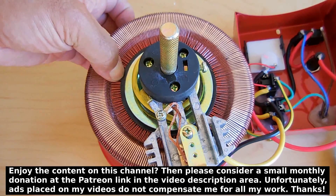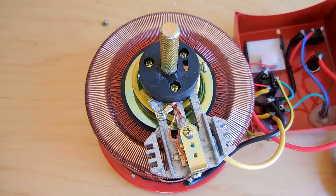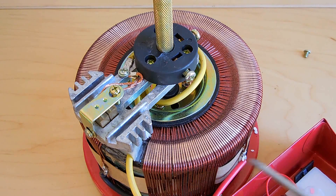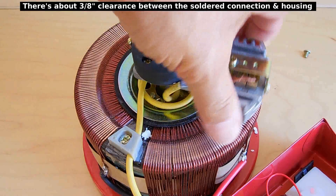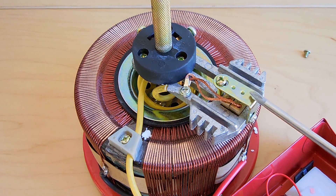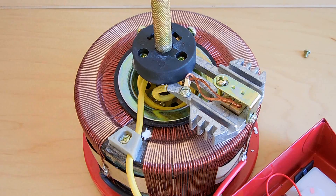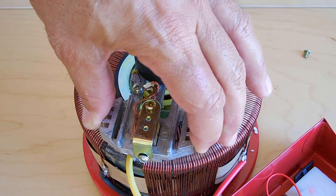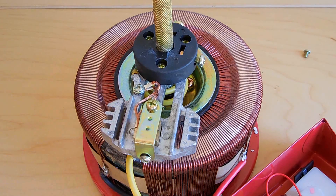Underneath the metal that keeps the shaft centered is a plastic — actually rubber — insulator between the windings and the metal. Here's the beginning of the winding, and the end of the winding is over here. The other side of the winding is tapped right here, so if the wiper is moved all the way to that point, that's the full 115 or 120-volt supply out of your receptacle. If you want higher voltage, you keep rotating past that point and you can get as high as 130 or 140 volts — very useful if there's a low-voltage condition and you need to compensate.